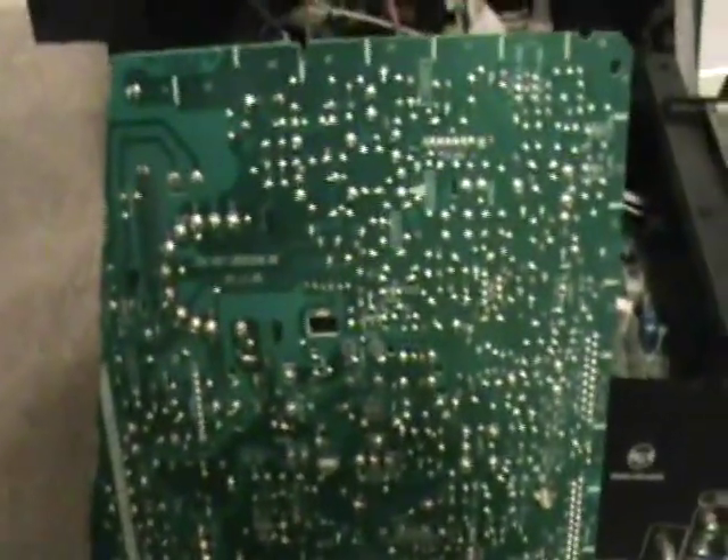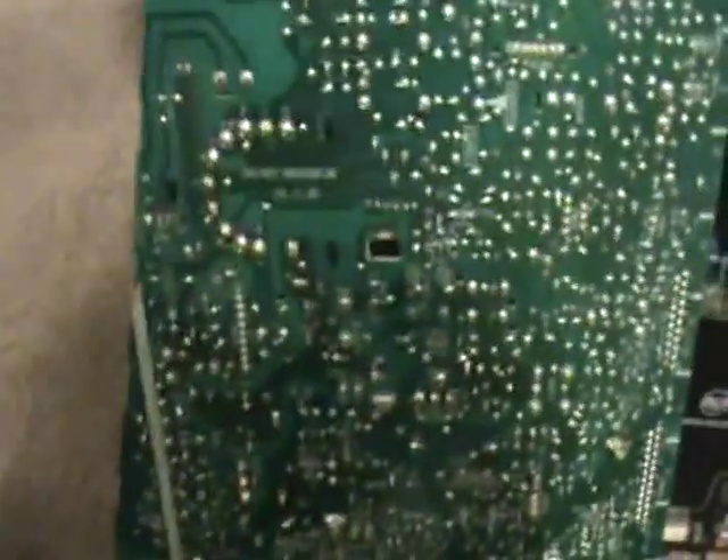It's a good idea — I took a picture before I took it out so I can remember where all the connectors go. Another quick tip: I put a piece of electrical tape to hold the fuse in while I soldered it — that keeps it from falling out while you solder the other side. I've got my laptop showing the picture of what it looked like before I unplugged everything, so I can make sure the right wires go everywhere. I'm going to put the back panel back on, plug it in, and see if it works.